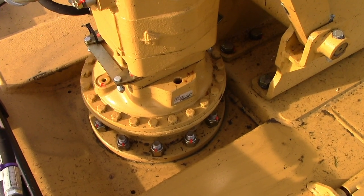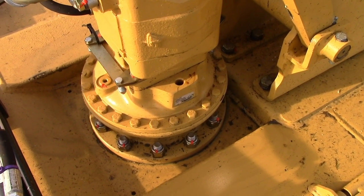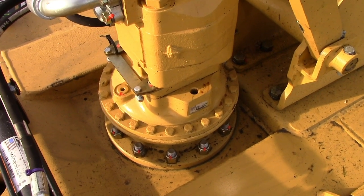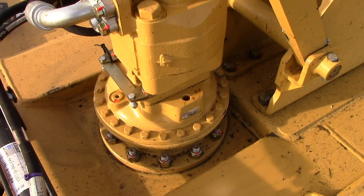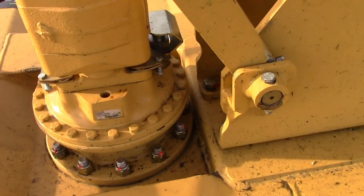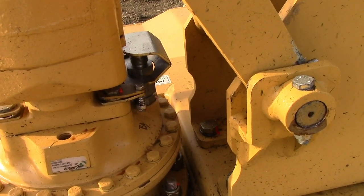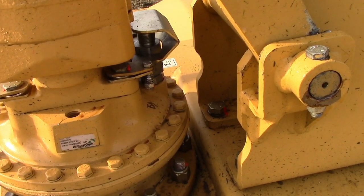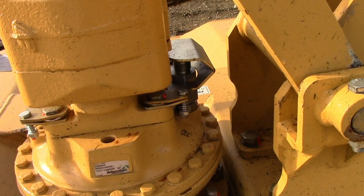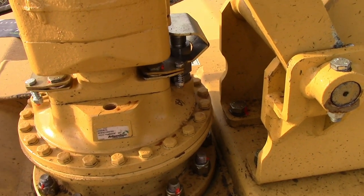Our direct-drive spindle here is an oil-bath spindle that uses 75/90 synthetic oil. Change the oil once a year or every 500 hours. The spindle also uses Diamond's patented replaceable splined insert in case of wear between it and the motor. The pressure relief valve on this side will protect the spindle in the rare event that the motor shaft seal fails — if you see oil purging from that relief, the motor shaft seal has likely failed.